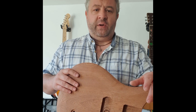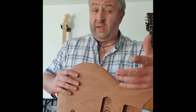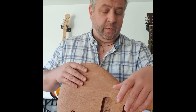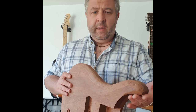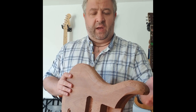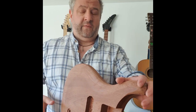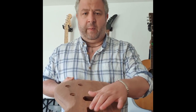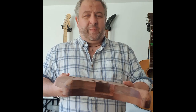When I was going to college, I was doing the beginner restoration courses, and then I started doing the advanced one, but I was actually using the advanced course in the college time to actually start to build. So that's what I'd done. At that point I had cut the body shape out. My friend Peter was good enough to let me come over and use his router table, because I didn't have a router table at the time, or a router for that matter. So cut out the body shape. When I was at college, I used my templates, and what I did was I cut out the neck pocket, the control cavities, back and front, and that was pretty much it.